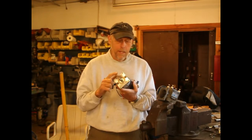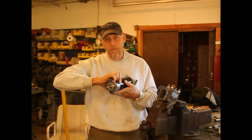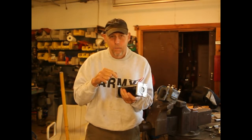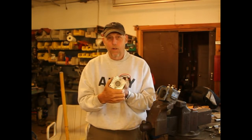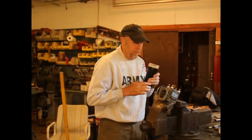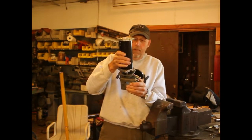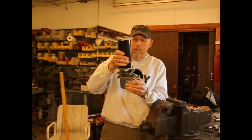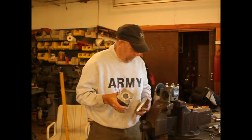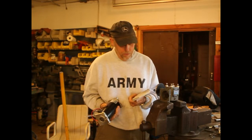At this point I don't have the drive — I've ordered the 0-to-90 volt DC drive. I'll need that if I want to use the motor as the power for the lathe, just using the lathe as a holder in a low gear. The other thing I've got to do is adapt this to here — it's just a half-inch, so I've got to make an adapter. I have a piece of 6061, but I'd really like to use 7075 because it's so much better to work with.